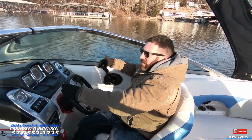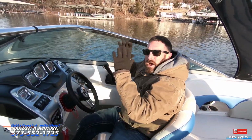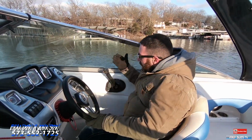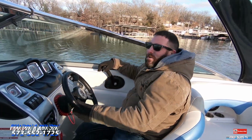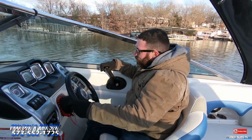Now, one more thing, tilt and trim, that's the outdrive. If you're unfamiliar with how to operate tilt and trim, also in the description of the video down below, I'm going to put a link that explains how to work that. But I've had a lot of people excited to drive. As they accelerate, they trim up. Motor's going to sound and run great, boat's not going anywhere because the propellers come out of the water. So you always want to start off with that trim down.